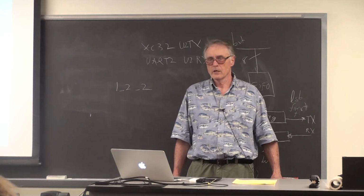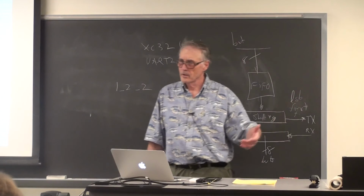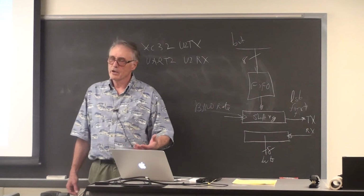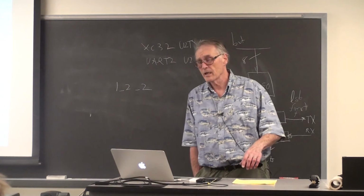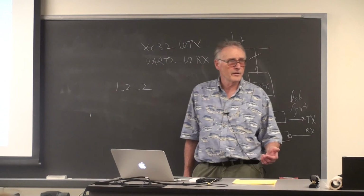Any more questions? As with all these things, you can set up the UART bare metal, no threader, just do the config and it'll run. However, some of you may end up doing that, but generally speaking, the ProtoThreads interface is going to be more efficient to use in the long run, because I already figured out how to do the swapping and the thread swapping to make it efficient.